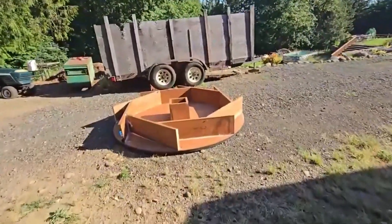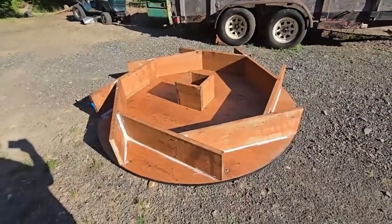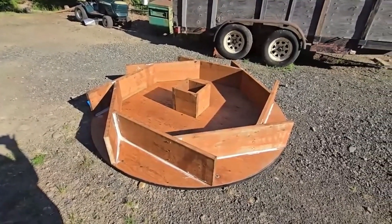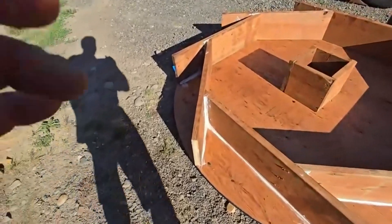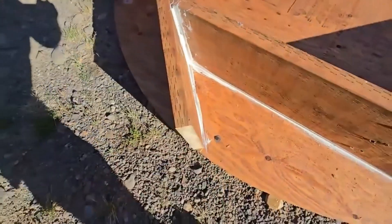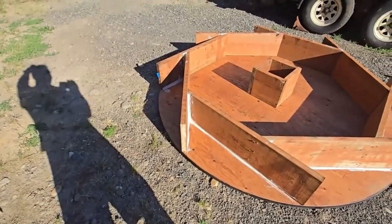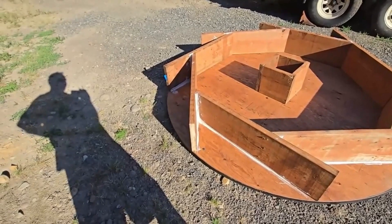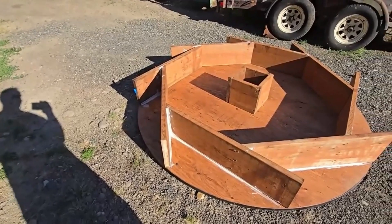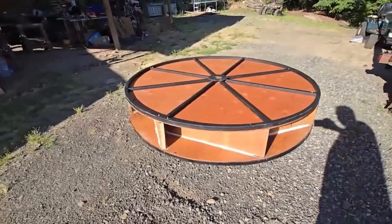Here's the other half of the wheel — the seven-and-a-half-footer. I made these out of cable reels, took the middle struts out of them. Those are two-by-twelves cut at 43 inches with a 45 on the end, and from this point straight across at a 90 off the board is about nine-and-a-half inches. That caulking is actually rubberized caulking — a tube broke so some of it looks rough, but it's flexible and should work well. There's the basic idea of our water wheel.